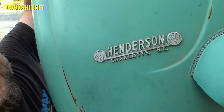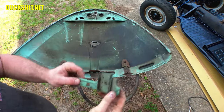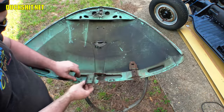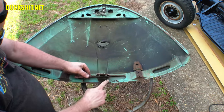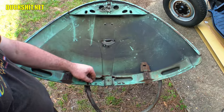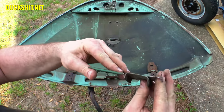I love that original dealership badge on there — isn't that cool? Talk about rarest of the rarest, you don't see a whole lot of those surviving anymore. Okay, this bit here lays in like this. This lip is way turned up, way out of place. The spot welds that were in here all pulled free or just broke loose completely, so they'll need to be fixed. I'm thinking I should probably be able to straighten this out to its original shape, clean both surfaces, and run my spot welder back along here in between the spot welds that broke off.